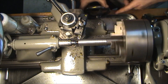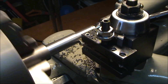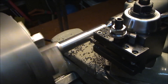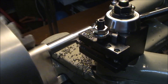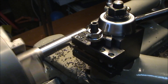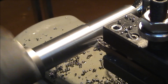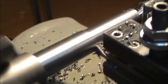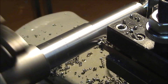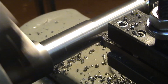I'm just going to whittle this down and I'll show you the final pass. After those first couple of cuts I realized that the tip on my tool was a little dull, so I added a little bit more rake. Basically that's what you want to see coming out of there — those chips curling up, not just flying everywhere. You can see we have a nice smooth cut. We were more rubbing on the other cut. So we'll finish this up and I'll show you that final pass.